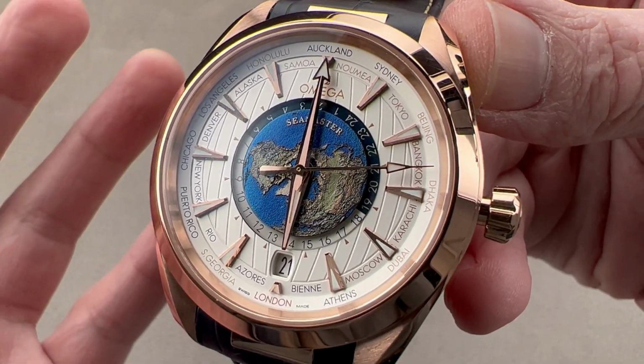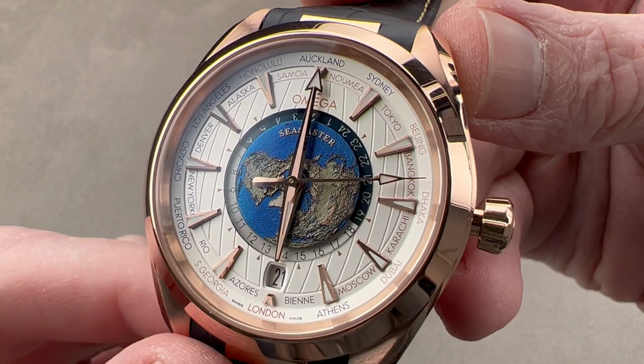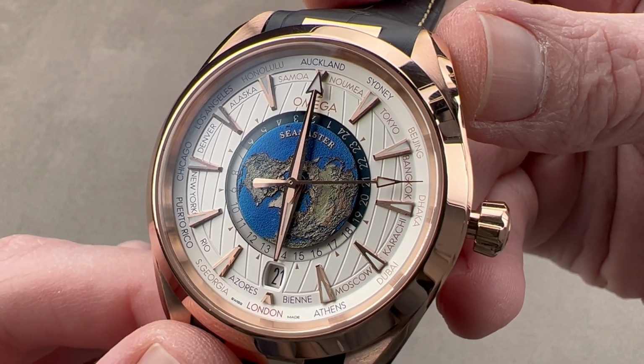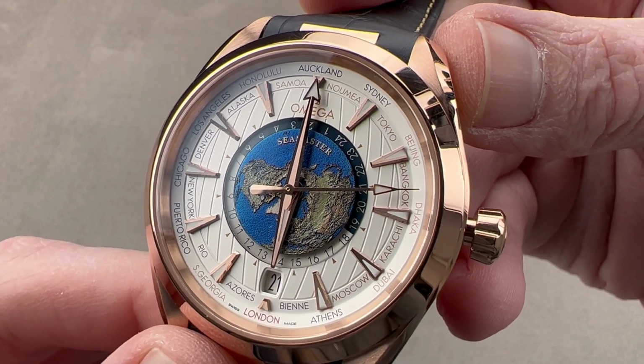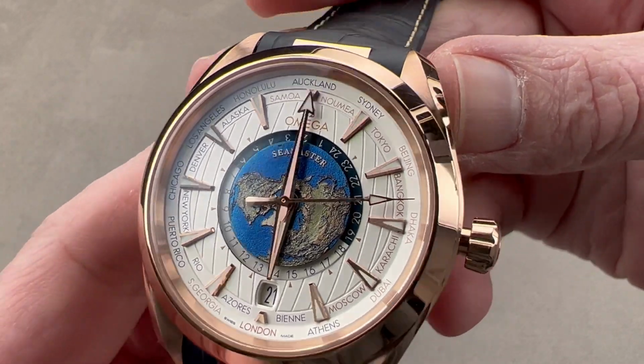The coax is a direct and indirect impulse tangential contact escapement that probably remains the most sophisticated escapement you can buy for under $50,000. It improves power reserve, chronometric precision, and diminishes the need for service.